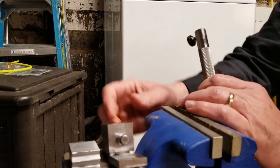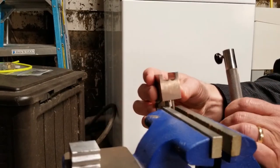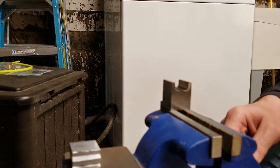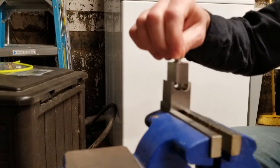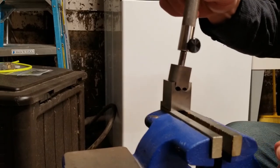So these are the tools that you'll use — here are the dies. This is the bottom die; set that on your vise. We can also make this so that you can set it flat on a table or a piece of steel. This die will go down in, and in order to hold that die properly, you should use a punch handle.